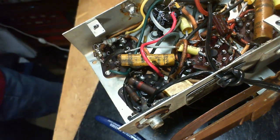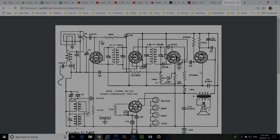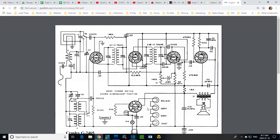Cathode and plate. Okay, back on the schematic here. Between the cathode and the plate. Did somebody just make a silly mistake? How could they have? You get the tubes confused and ran the capacitor to the wrong K, to this K, when it should have been that K. Is that where the hum comes from? This capacitor in this position doesn't exist.